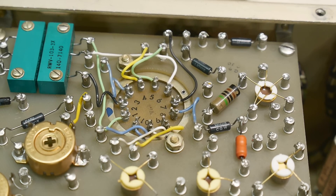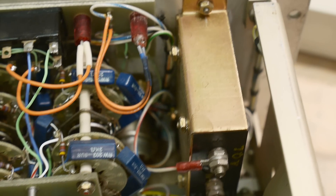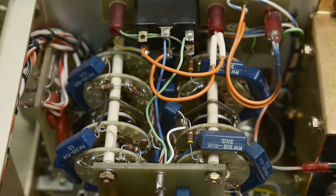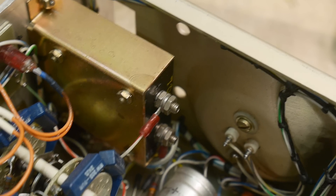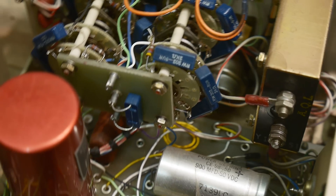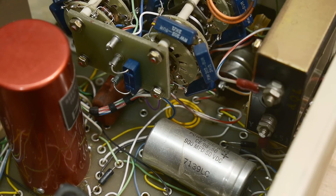Let's take a look at the expensive parts — those switches on the front must have some nice resistors. And there they are. They don't have a percentage on them — RW of 202, it's a 2k. I don't know what precision those are; I've never ever seen a resistor that looks that way. They are square resistors — interesting. There are some capacitors in here that are probably aging, and the capacitors are marked with Power Designs branding — branded capacitors they bought specially for this thing and had their name put on them. Pretty wild stuff.